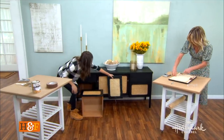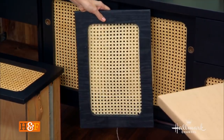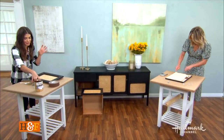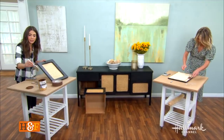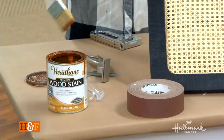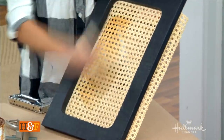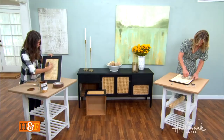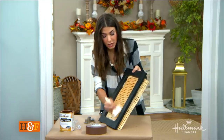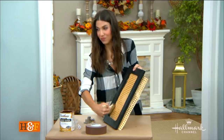Look at the color difference — I personally really like the warmer tone because it feels more vintage, like a really good find. Take a nice light coat of stain, don't use a lot, just dip it in, pull off some of the excess, and buff. Go in and then buff, buff, buff — and you can get into the corners. I did some before attaching and some after. Either way totally works.